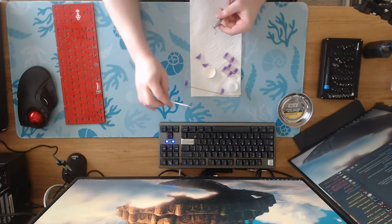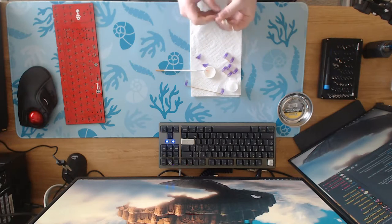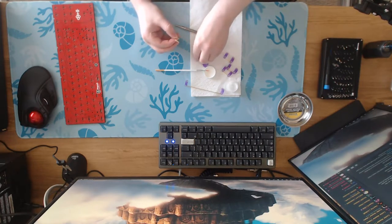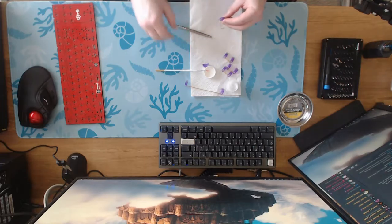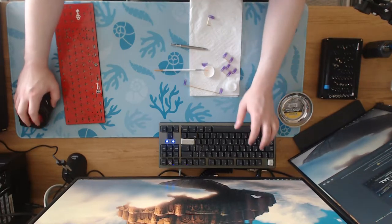What switches do you have problems with the Milmax? Do Zeal switches fit well? I did have to file down some of the pins on my Zeal switches to get them to work. But it's not a big deal. It takes like 10 minutes. You just swipe the thinner leg or thicker leg just two or three times on each switch and move on. But not a problem.